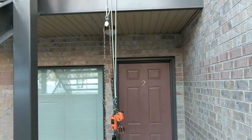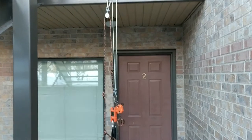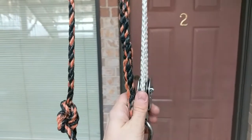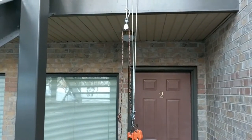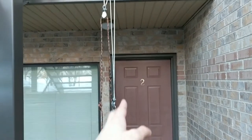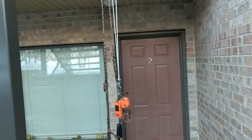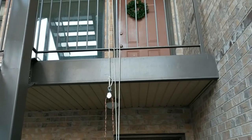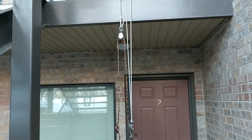The orange rope has a two-to-one. The left side is the fall — the side you pull. The side on the right goes down to this carabiner with the pulley. So when I pull with one unit of force on the fall on the orange rope, I've got one unit of force on the load. But I've got two units of force — it's a two-to-one — onto the white line system, which is also a two-to-one. This pulley is doing the work; that's just a redirect. So we've got a two-to-one system with the white that goes down to a two-to-one with the orange.